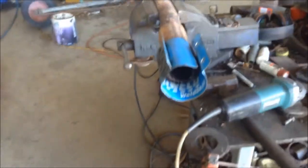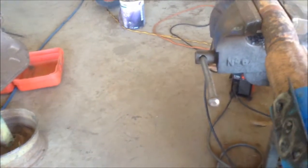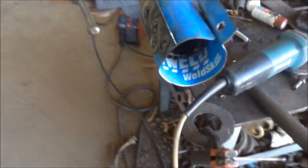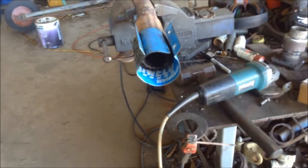I need to get some square bar and put 2 holes in each side. It needs to be like an inch square. I suppose I'll use some box. And that's so these don't bend over flat. If the bolt's going through, it can't twist that over flat. And then it's ready to go back on a truck, I think.